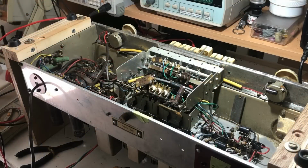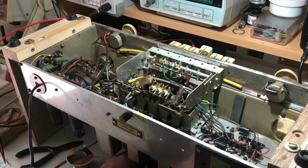So we're on dim bulb again. It's gone down quite a lot. We'll just see if we get anything happening here. Oh yeah, we've got faint crackling from the speaker. Nothing smoking either. I'll just wait for a minute and see if anything happens. So that suggests perhaps that cap wasn't good. I'll see what value it is. Maybe I can replace it.